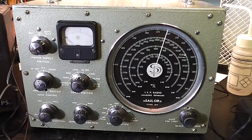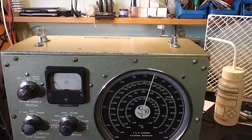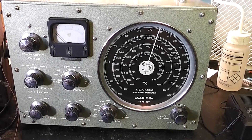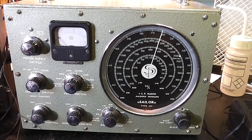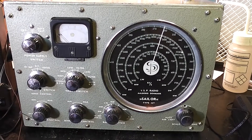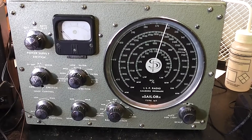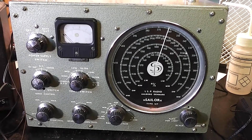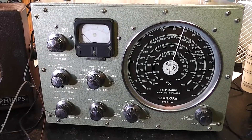I've got my radio going — it's a nice looking radio. I'm sure it looked very nice on a boat at the time. It's got a couple of hooks at the top to allow it to be mounted on the wall. What attracted me to this radio is the big dial at the front — I'm a bit of a sucker for a big round dial. The meter is damaged so I'll look out for a replacement. The dial light switch doesn't work, but I've just made it permanently on because I like the dial light to be on. I didn't do anything to the IF stages or the front end because everything seems pretty well in alignment, so I decided to leave it alone. The IF appears to be 470kHz, just in case that's of use to anybody. Thanks for watching, I'll see you on another video.